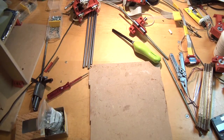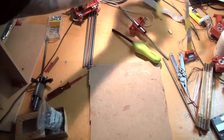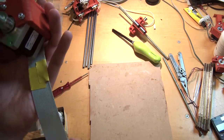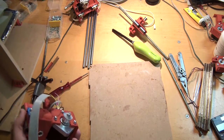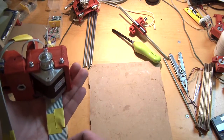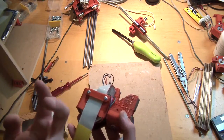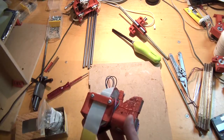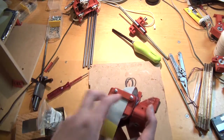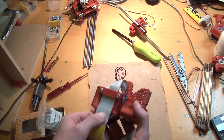Now for the really embarrassing part — don't judge me by what you see right now. The print stopped about three times printing this part. This is the X-motor bracket. You need to find your second ribbon cable — this ribbon cable goes through here. There are two nut traps on the inside. You have to attach this belt clamp first, before you insert the motor.